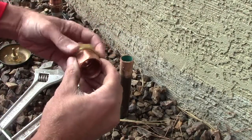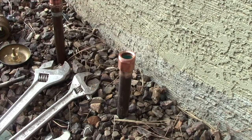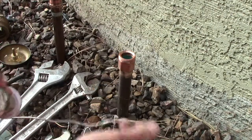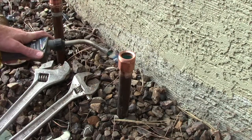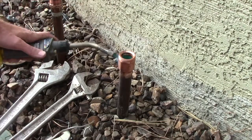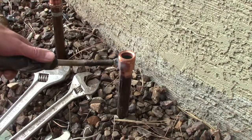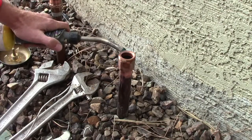I'm gonna take this off and put it on like that. A rule of thumb here is I'm going to use one inch of solder - right about there - but I'll probably use more because I'm not really that good at soldering, as I've said in my other videos. I like to keep the heat on the other side and touch the solder on this side so the heat draws it all the way around. You can see a change in color at that point - it's probably about ready.